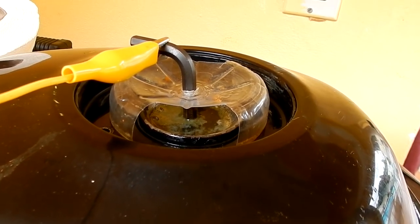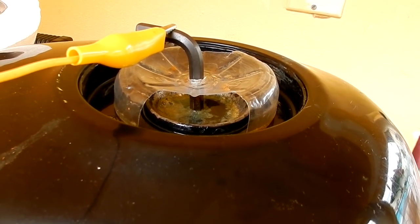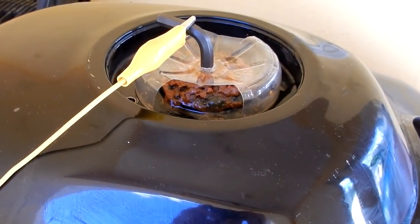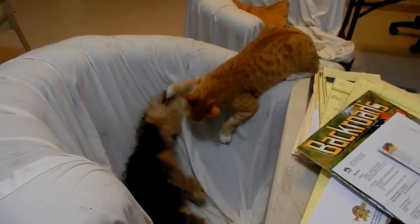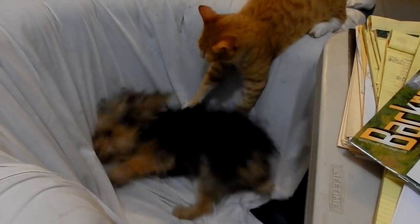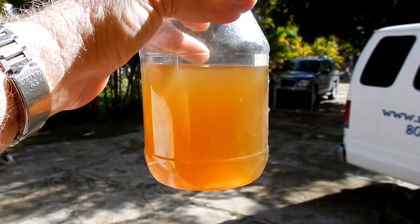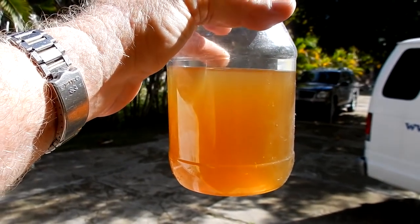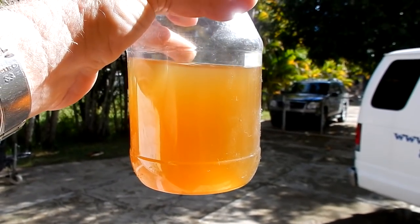I cleaned it up, added fresh water, and you can already see it start to bubble up with hydrogen bubbles — so the reaction is still occurring three hours later, and it's really starting to bubble up now with more rust and gunk. I siphoned some liquid just to take a peek: the liquid that went in was virtually clear — nothing but water and six tablespoons of sodium carbonate — and you can see it's now hardly clear at all.